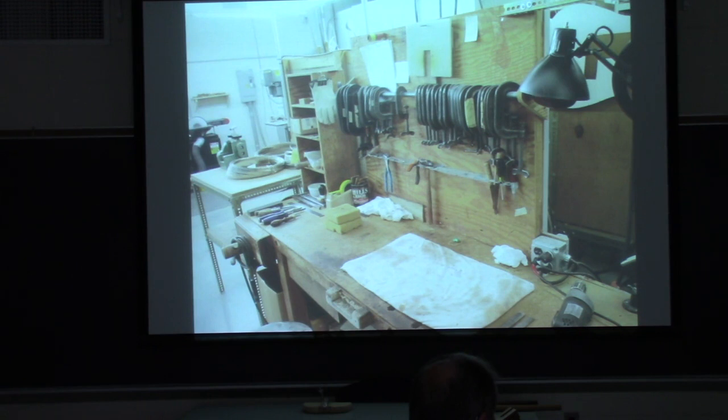Do you drill 1 or 2 holes? I drill 2 holes on any guitar that does not have an adjustable truss rod. The reason is I want the steam to come out in the area where I want it to come out. I don't want it to come out down the end of the fingerboard or out a fret end. Sometimes steam has a way of moving in different areas, so I create a relief valve.